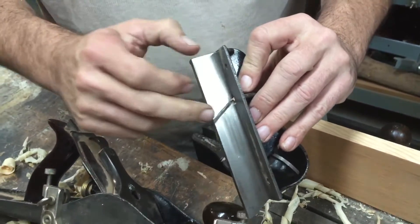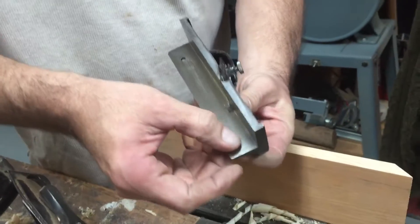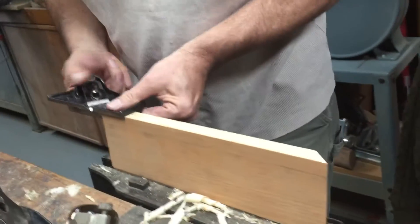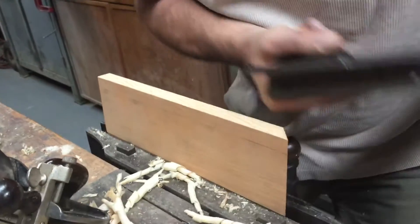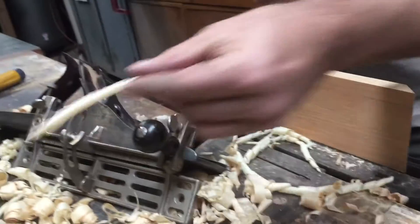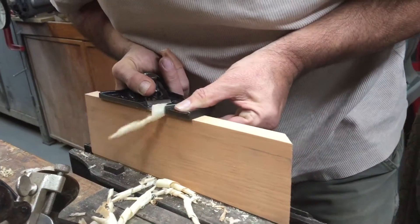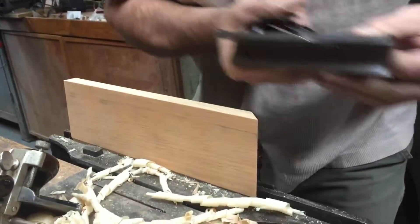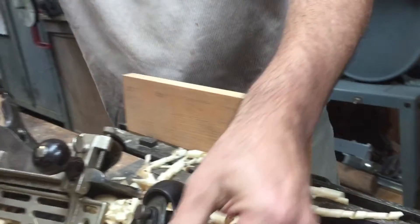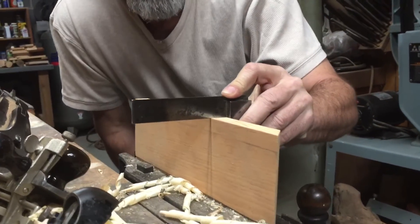The number 95 is great for a little toolbox and you can only do three-quarter inch board or five-eighths. It has room for an add-on fence and a low angle, so it's good for end grain. You'll see how good a curl it gives — just like a spill plane, it gives you a little spill, which they used to use to light the fire in the shop. This one just rides on the side of the board, and in the end, no light — a perfectly square edge.